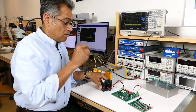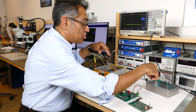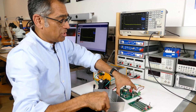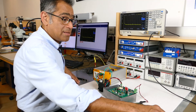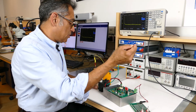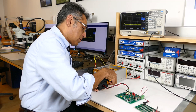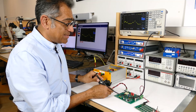The spectrum analyzer goes to the back. If I have a three-wire system with a chassis, then the back of the LISN is connected to the ground plane, then you have your protective earth cable going to the enclosure — your product will be inside the enclosure, and that is how you make the measurement. This is a pre-compliance test setup and we've got a ground plane here with the back of the LISN connected to it. Now I'm going to take this off, power up my power supply — it is powered up — and now I'm going to close my clamp, and you can now see the spectrum that is being emitted and the current clamp is picking it up.